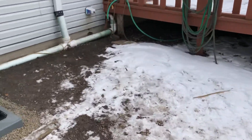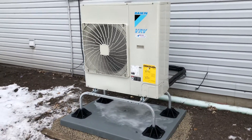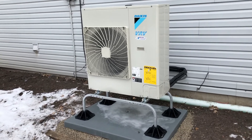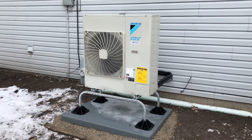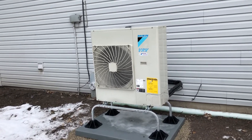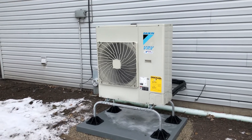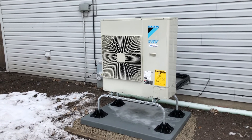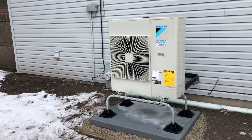It does run a little bit higher on the fan speed when you're in wintertime. In summer when we're air conditioning, you can barely tell they're even running. You may see in some of our other videos there's a little accumulator box to the side or behind — that's when we're using a gas furnace combined with other items like ductless, like I have at my own home. You do have to have that accumulator there for any extra refrigerant, depending on what's running and somewhere for the refrigerant to go if it's not all calling.